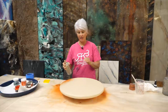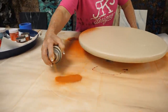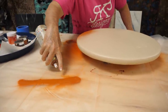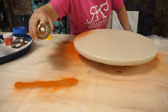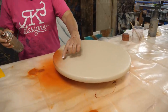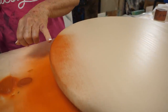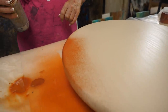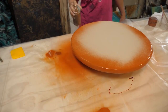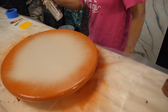When you fog the edges, it's very important that you don't create a hard line, because that hard line could show up through your finish. You want a very soft fog so your edge is covered without any hard lines. We'll let the spray paint dry for about an hour until it's not tacky, and then we'll move to the next step.